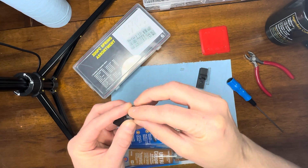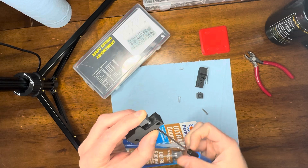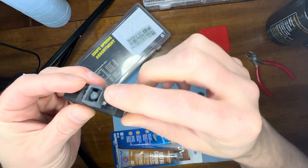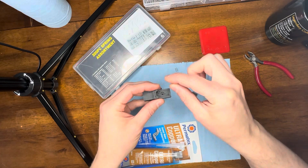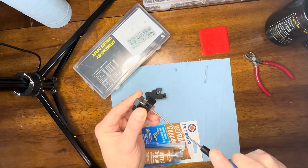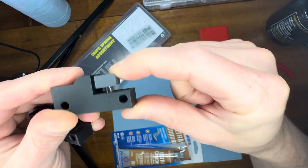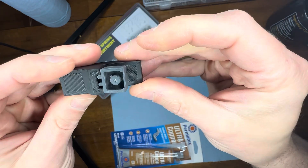I have a small hole in there and that's just going to be to help cure the silicone when the time comes — I'll get through that in this video a little bit later on. So you just put the cup in and screw it down right till it bottoms out, and that's about how much height you get. You can see it moves. When your hot end comes in it's going to hit this little 45 and push it down and block it. This is an M3 by 16 — you should be able to go all the way down to 12, and I think you could probably get away with a 25. You can see the difference between the 16 and the 20; on the 20 you're going to have more popping out. And that's basically how they assemble.